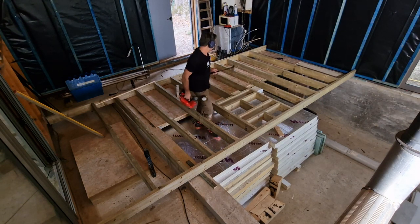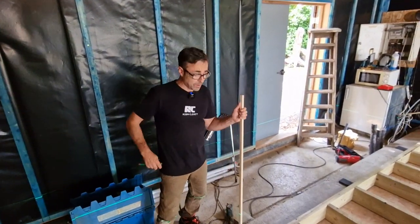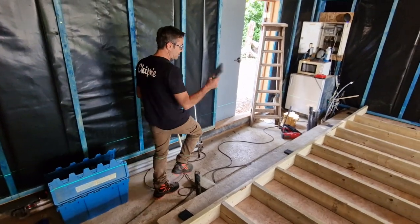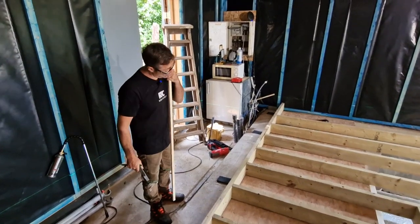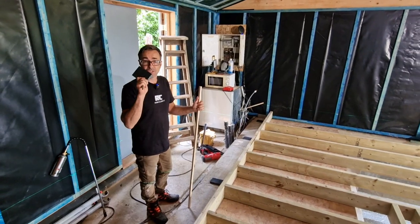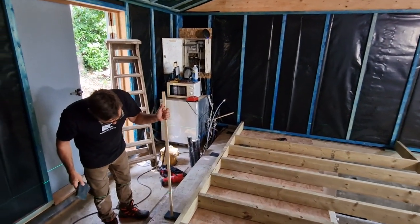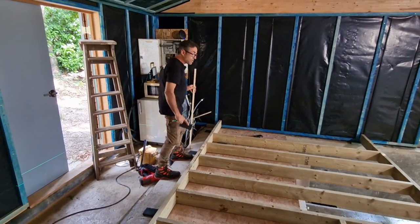Okay, so now we're going to brace the wall square. So the wall's complete, everything's in the right places. And as I mentioned before, we've got our plastic ply. These are like feet effectively. This is what separates the timber from the concrete. Now the timber could hit the concrete, there's not a problem there. There's no damp or moisture unless there was a catastrophe or a leak. So what we've done is used the level, the laser and a staff, and we've positioned all of these little bits of plastic ply so they're all nice and level.